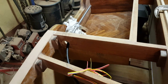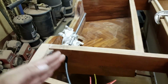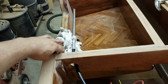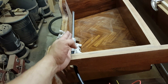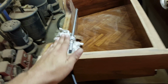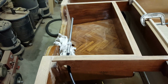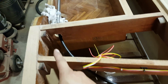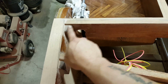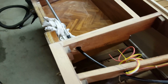So I did a ton of research, just digging and digging and digging, trying to find out about where this hole needed to be. I was trying to look for the distance from the inside face of the transom to the center line of the steer cable, tilt tube, and also elevation-wise from the top of the motor bracket to where the tilt tube was going to be. And I think I'm pretty close. Of course, that's a 1.5 inch hole, and the cable's only about 1/2 inch wide or so. So I've got room to play around a little bit and fudge it. But we drilled that hole.